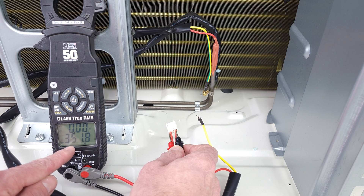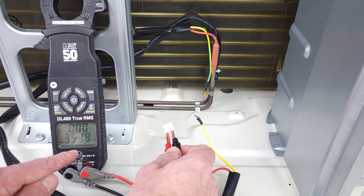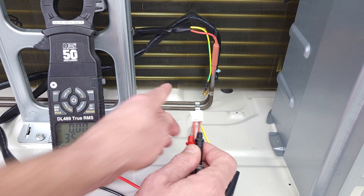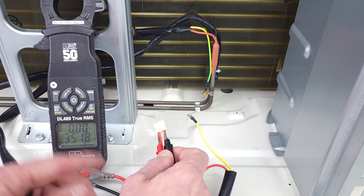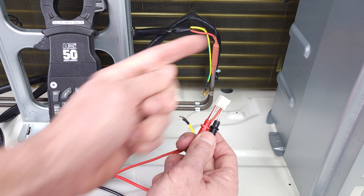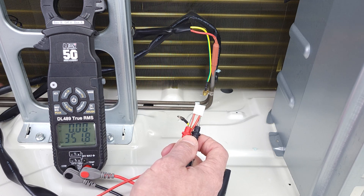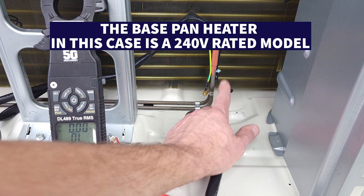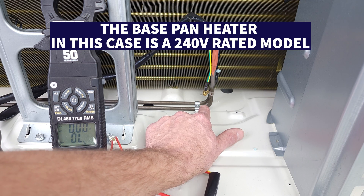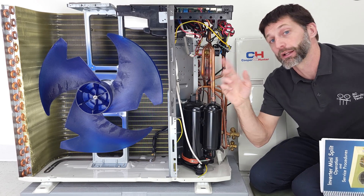If the heater was bad you would see a reading in kilohms or OL. If the wires were shorted you'd see 0.0 ohms — all of those indicate a bad electrical resistance heater. The other thing is you could have chafed wiring where it comes through into the electrical compartment where the main PCB is located. In this case our electric resistance heater is intact and good. This base pan heater is rated to be powered with 240 volts anytime the main PCB turns the power on to these wires, and remember we would normally do our testing up in the electrical compartment.